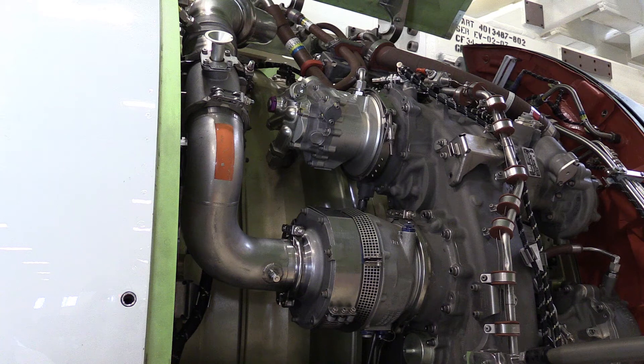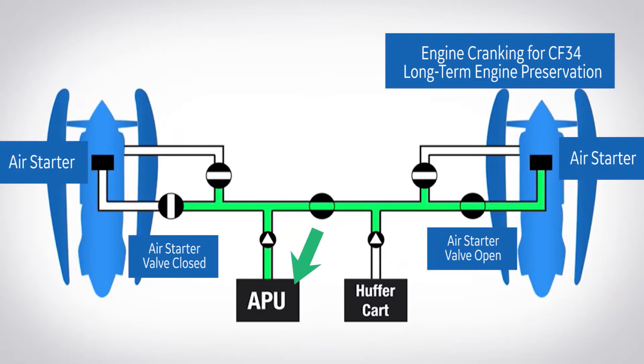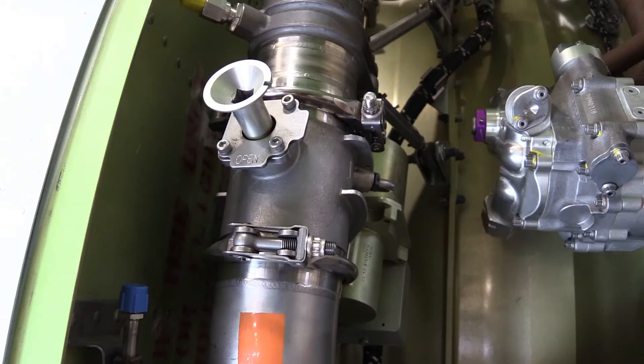Before we start cranking the engine, you have to make sure that in the aircraft you've deactivated the fuel system and also de-energized the igniter by pulling the breaker. When you come over to the right side, you want to look at the starter and, just like the oil tank, make sure that it is also at a serviceable level. There are two ways to crank the air starter: if your APU is still available, you can go ahead and crank it for the five minutes using the APU; if not, use a ground support air supply cart. You simply go to the starter air valve using the override and crank, letting the air run through. For the oil system preservation, you basically just run that for five minutes.